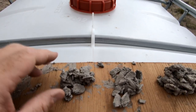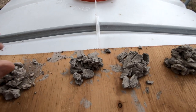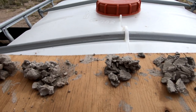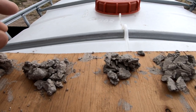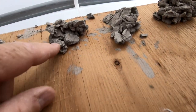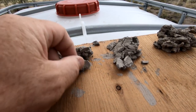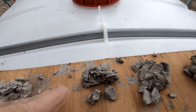The confined aquifer is usually only accessed if you need a lot of water for agricultural uses or something like that. Both aquifers in this valley are separated by a very thick, very definitely identifiable kind of clay they call blue clay. This looks more gray, but believe me, when it was coming out of the hole it looked kind of blue-gray.